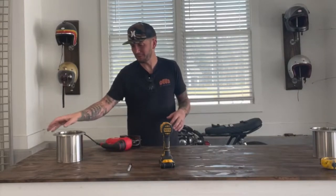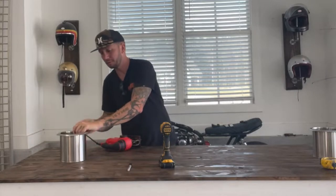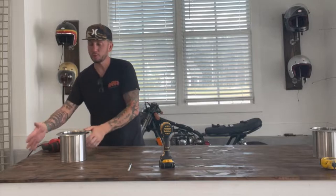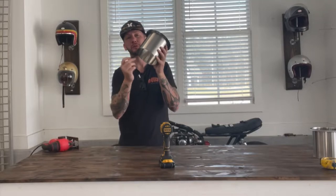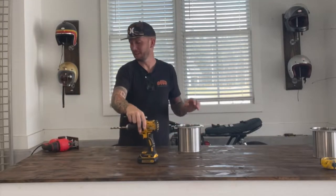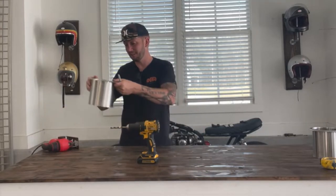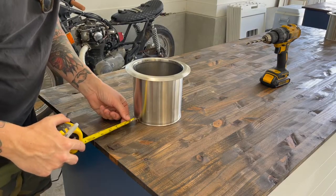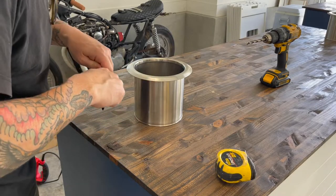So I picked up some trash can rings for this. These are stainless steel. So what I'll do is, about dead center, splitting the difference of the tabletop, and about 12 inches in, I'm gonna cut a hole. I'm gonna trace this bottom hole with the marker, use my drill to create a little starter hole, and then use the jigsaw to cut this round hole and insert these, so I can put trash cans on either side, and this will kind of streamline the whole table. So I'm gonna go 6 inches in, dead center, and then trace this down here.